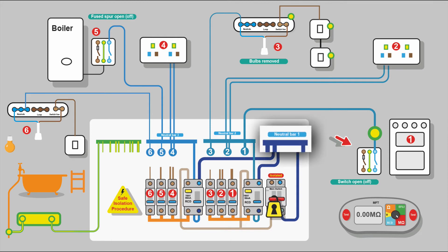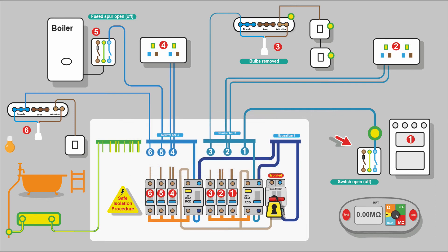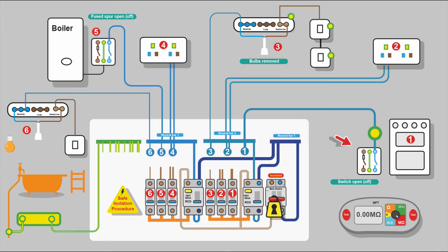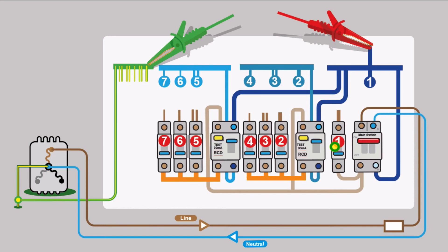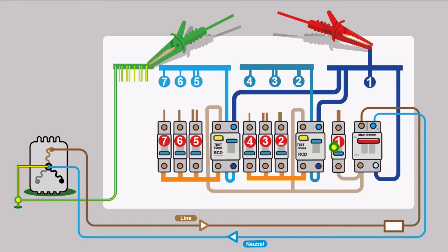In this example, we've got three neutral bars: the supply neutral bar and two neutral bars connected to the RCDs, giving two groups of circuits independent of each other apart from the CPC connections. We're not connected to the supply neutral because the installation has been isolated or the supply hasn't been installed. The neutral will at some point be connected to the earthing system, and during testing you can pick up that neutral through the CPC connection — this is one of the reasons why the installation needs to be isolated during testing.